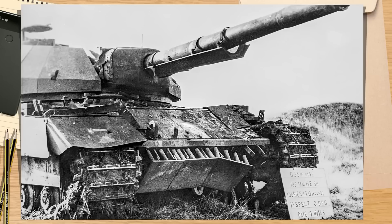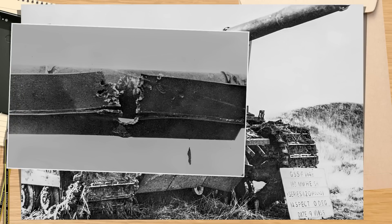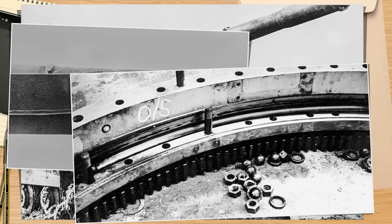The 183mm hitting the front glacis with 6 inches of spaced armour blew off the front plates, buckling one of the 20mm applique plates and fracturing the rest. The blast tore off the left track guard, dislodged the lower array and sheared off a towing eye. The upper and lower nose plate was cracked along its weld, as was the top plate to the glacis. The blast also damaged the sheath protecting the gun with an 8x12 inch hole. Internally the driver's scopes were shattered and the turret ring was temporarily jammed. Many modules were damaged, jarred or missing parts, and the driver's controls were broken, but he himself would have survived. The end result was that this was a mobility kill.